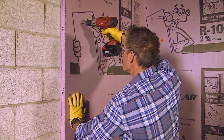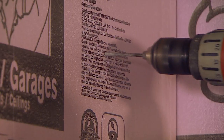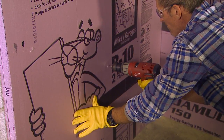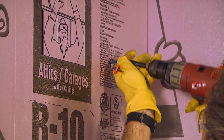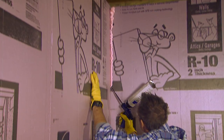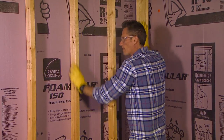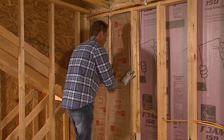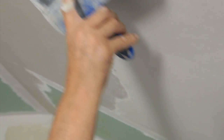For the screw method, begin by marking the Foamular for three fasteners. Use a good drill with a hammering function and a concrete drill bit of the correct size for the concrete screws you're using. Drill a hole in each location you marked on the wall. Cut the Foamular as necessary and trim around any obstacles. If the boards won't lay flat, use shims as necessary. Install Foamular with screws and caps. Fill any remaining gaps with Owens Corning Propink 1 or a similar spray polyurethane foam. Finish the project by building the framed wall right up next to the Foamular. You can install EcoTouch pink fiberglass insulation between the wall studs if a higher level of insulation is desired, then finish by installing gypsum drywall.